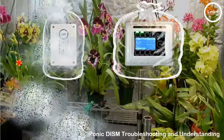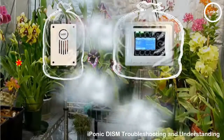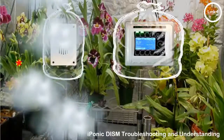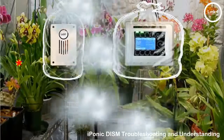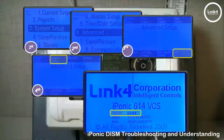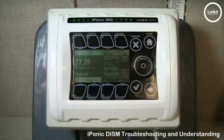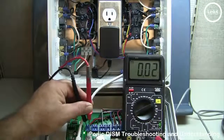If you are planning a pesticide saturation or sulfur burns, make sure you cover, bag, and protect both the sensor module as well as the controller if the controller is inside the grow room sealed environment. You also want to keep your controller up to date with the newest firmware versions and make sure your sensors are mapped correctly. Other issues causing sensor irregularities include a marginal power supply not sending adequate DC step-down voltage.